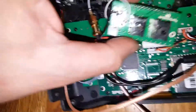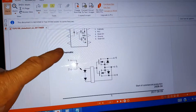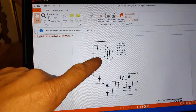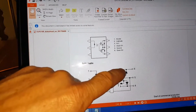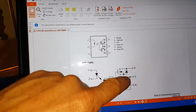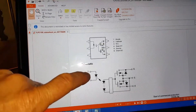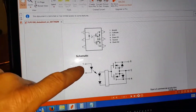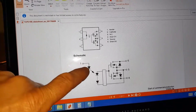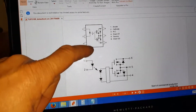So I had to make an internal switch, which is an opto-coupled FET from Toshiba. The way I'm wiring it is: my battery plus goes straight through to the power amplifier, and then my 3 volts from the transmit LED built into the transmitter goes through a 220-ohm resistor, turns on the LED, closes the FETs. This is the same thing as a solid-state relay.